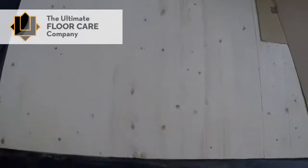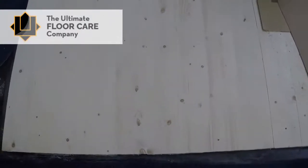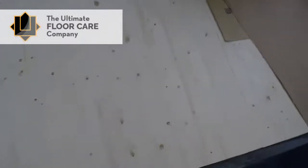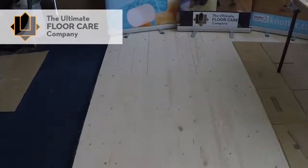Okay, so now we have filled this floor completely, sanded the filler off, and smoothed the floor to a fairly high degree. Because it's pine, you need to sand it very smooth in order to get a really good finish. Completely filled — so there we are, there's the unfinished unfilled section at that end, and the filled section at this end.